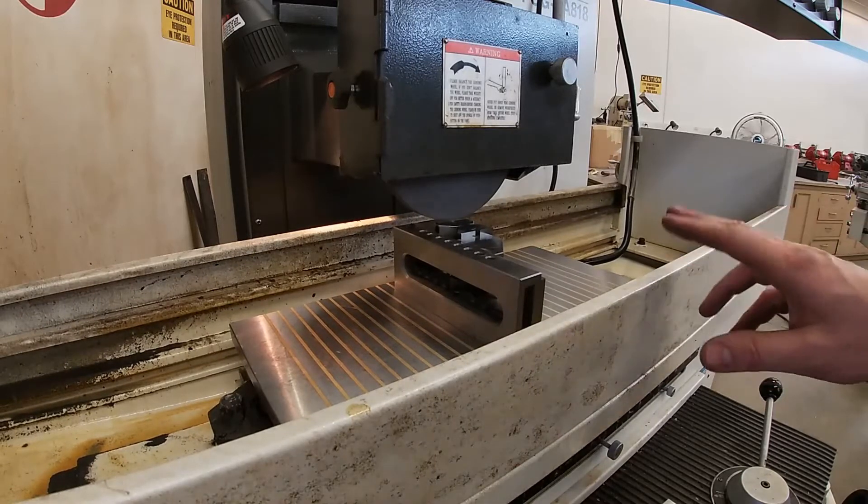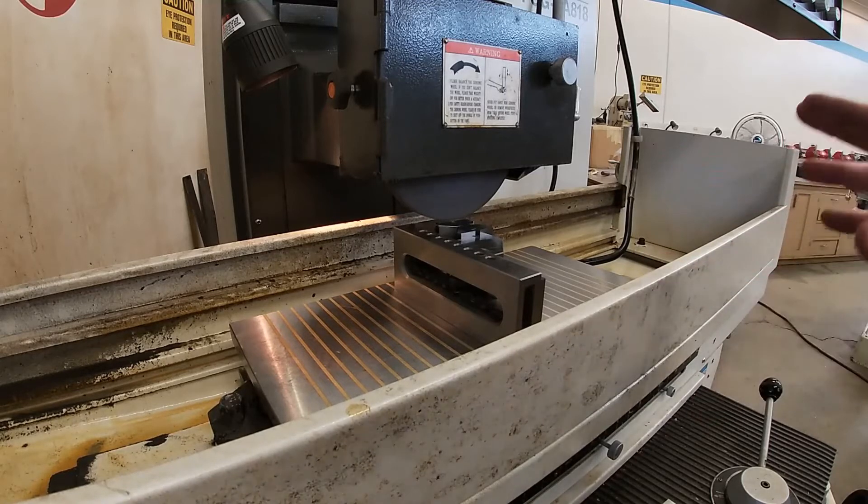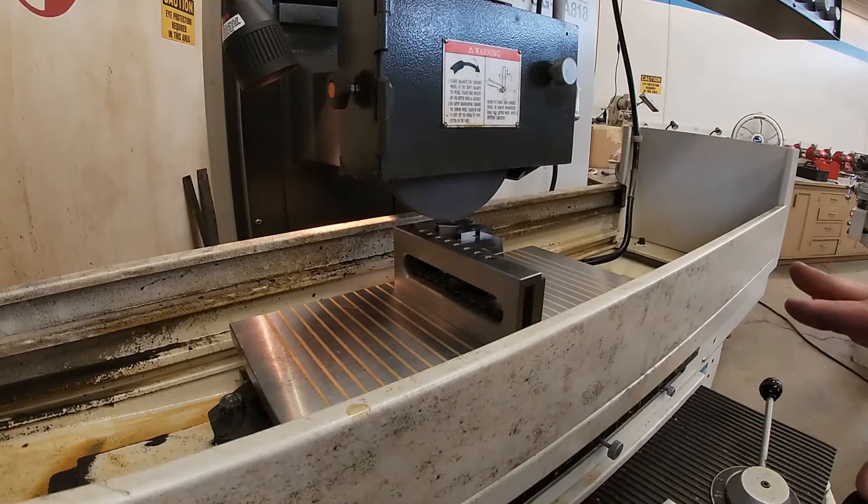I've been pretty happy with the cleanup after the milling operations — the part was pretty square. I never actually inspected it like we're going to inspect this part after I grind it on camera, and I probably should have. But it's not taking very much at all to clean up on the last surfaces that I ground — I'm going to guess within about a thousandth and a half of downfeed from the original touch-off, and that was completely clean across the entire surface. So for the milling that I was doing, yeah, I'm okay with that.